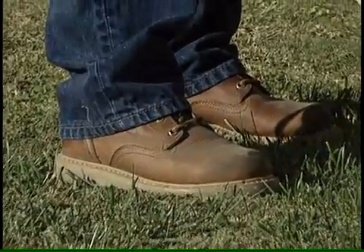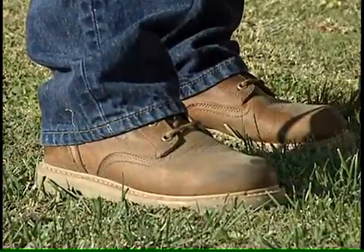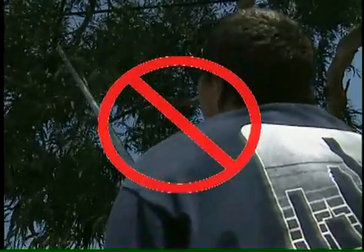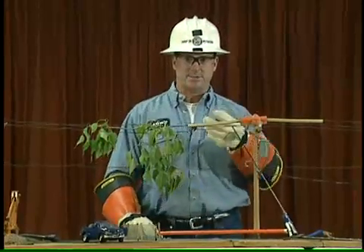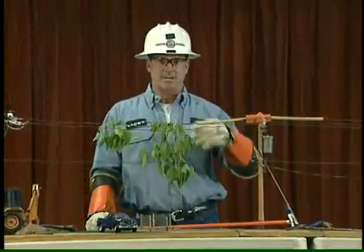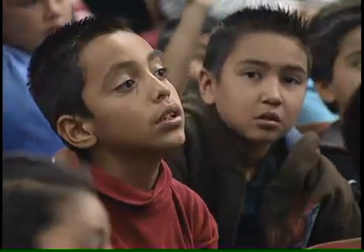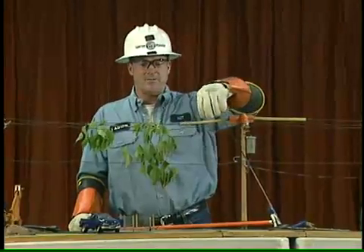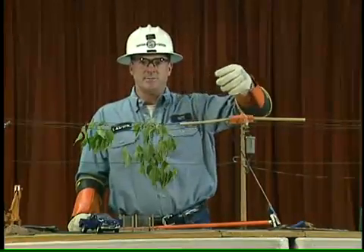It's a good idea to operate electrical gear wearing rubber-soled shoes instead of going barefoot. Still, rubber soles only help with low voltage under ideal conditions. Don't trim trees yourself if power lines run through them. What a lot of people don't realize is that trees absorb moisture and minerals from the ground, making them conductors of electricity. So not only is the wire itself a hazard, but the leaves and tree branches can become a hazard too.